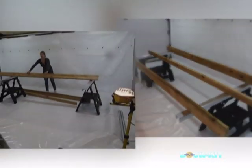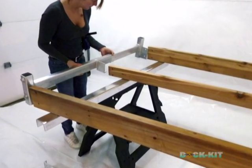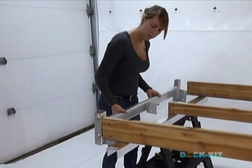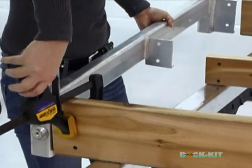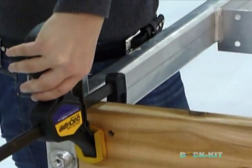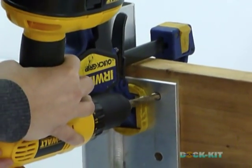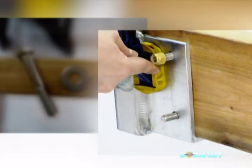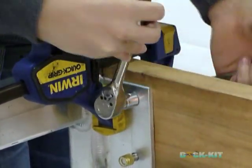To start the assembly, first place the outer frame beams and the center brace beam on your working surface. Next, position the welded aluminum end support into place. Position one of the wood frame beams into the end support template, and anchor the beam to the end support securely with your bar clamp. Drill a 3/8th inch hole through the beam using the metal template as a guide. Apply washer and bolt through the wood beam and end support template, then screw the nut onto the bolt using both the socket wrench and hand wrench. Tighten the bolt securely into place.